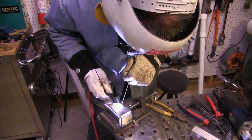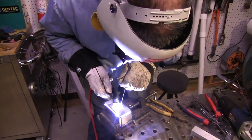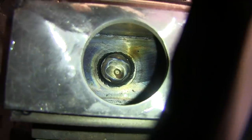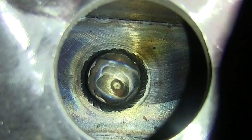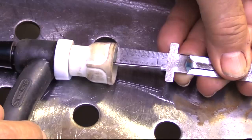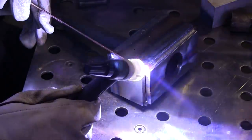I'm wearing a passive helmet here that my friend Alex Brown sent me, because you'll get flashed a lot of times welding down in a hole like that with an auto-darkening helmet. It didn't have any trouble getting good shielding filling that thing in. Here's a close-up of the stick-out - it's just a little more than an inch and a quarter. Worked fine.